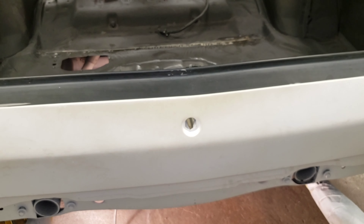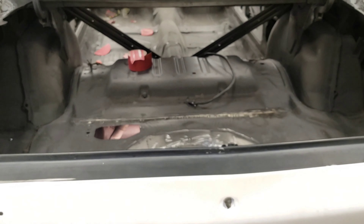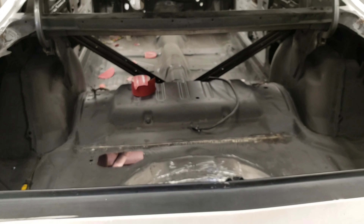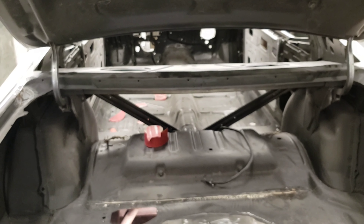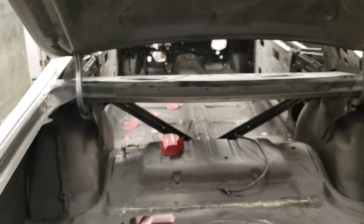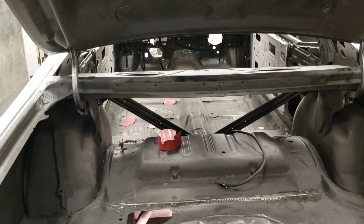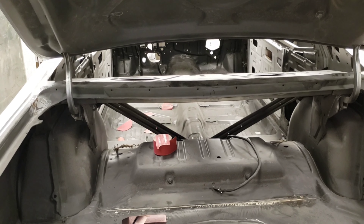On the bottom, I'm going to leave the gas tank out because we've got to get the whole underside of this thing undercoated. The floor pan up there does not have anything but E-coat on the bottom side of it, and I didn't want to put undercoating on it and then put it in the car and take a chance of it catching on fire because it was so fresh while I was welding on it.